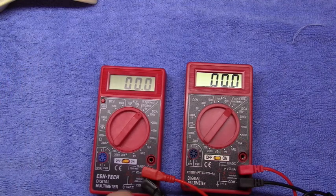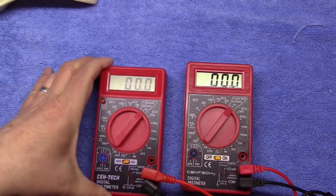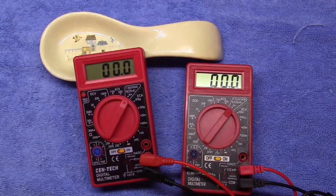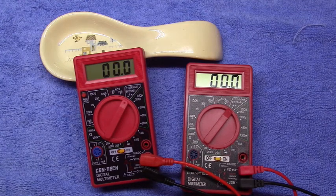We'll try it on the other meter. You probably can't see the display, but it's reading 26.2 — 26.3. So they're in agreement with one another; they're not going to be exactly the same. The AA battery reads 4.4 milliamps; the silk screen says 4 milliamps for a fresh battery. On the other meter it reads 4.2. They're about the same.